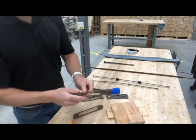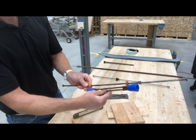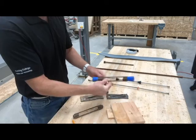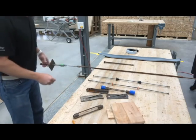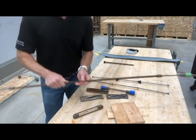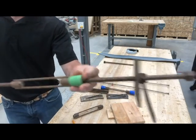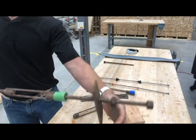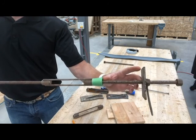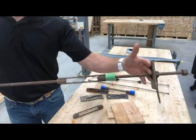Back here we have a coil tie. This coil tie would be a 10-inch coil tie. It does the same function as a snap tie — it's just a heavier duty outfit. Here's a coil tie we have set up — that would be a 54-inch coil tie on the same concept. The coil tie sits in the middle. There's our plywood out here. This is like a big washer, and this is just a wing nut that we use for tightening. This is adjustable — we can put as big a size of threaded rod as we need for whatever we've got between the form ply and the outside.